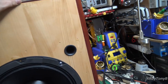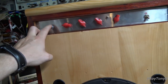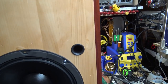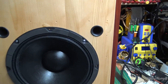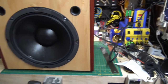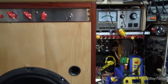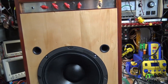So I'm going to modify this. I already dropped the gain on the first stage right after the input jack and it helped a lot. But the amp still has too much hum and too much gain. The thing is, if you modify the gain of the next stage after that, it's going to affect the feedback circuit, the presence control, and everything. This presence works really well, but it will affect it. So we're going to have to recalculate the presence control and the feedback loop.